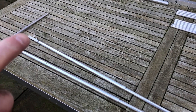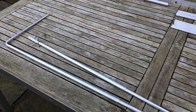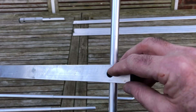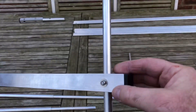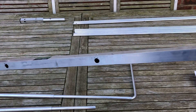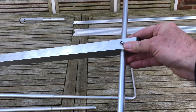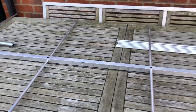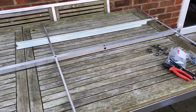That's the insulation in the center of the dipole that passes through the boom and is insulated from it. With the reflector, the centerpiece just passes through the boom and is held with a nut and bolt. They're all the same — they just pass through, apart from the dipole which is different. So here are the centers all attached to the boom, apart from the dipole, which we'll add now through that remaining hole.